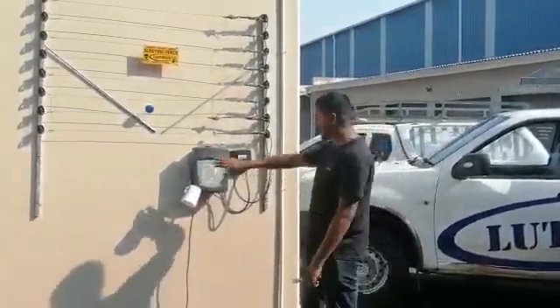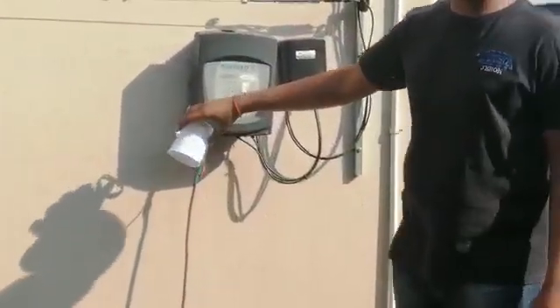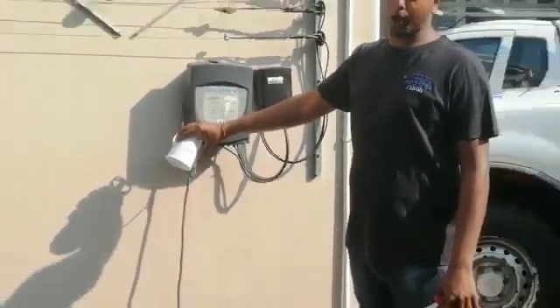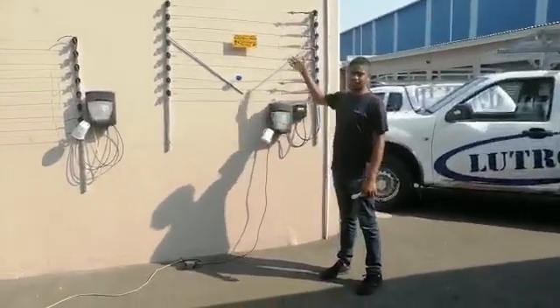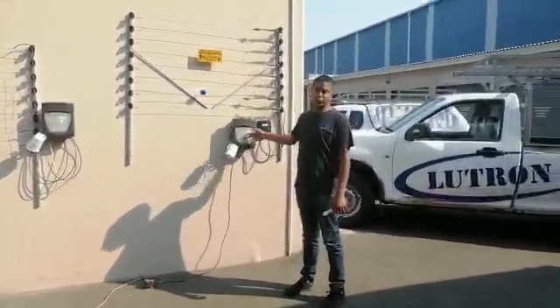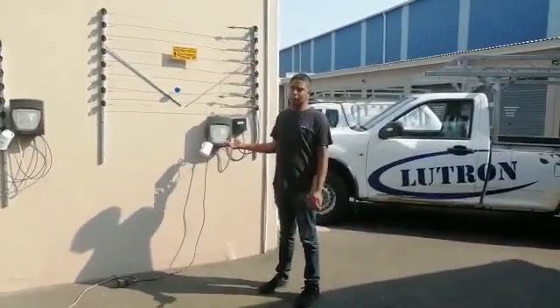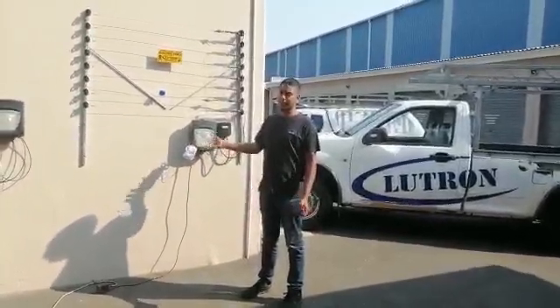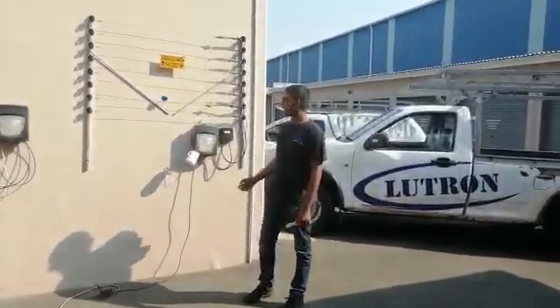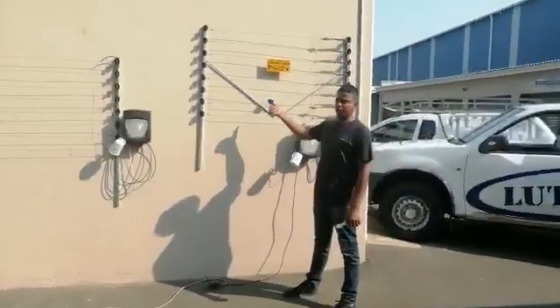This is the energizer and this is a siren. We always recommend a siren on our fences. You could put an electric fence up without a siren, but the downside is that when the fence alarm is activated the energizer makes a noise — and if the energizer is installed in your garage or a room you're not going to hear it. With a siren, you'll be alerted by the siren noise and you'll know someone is on your property.